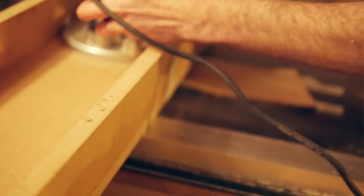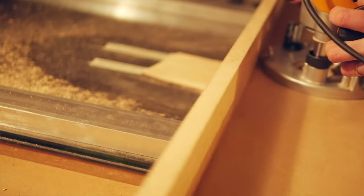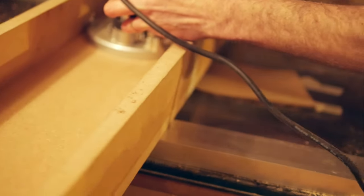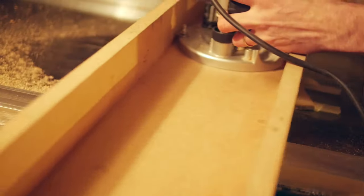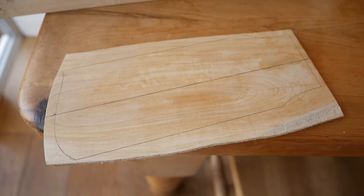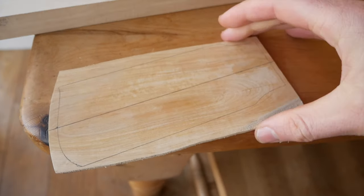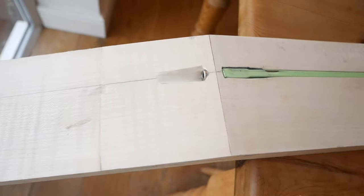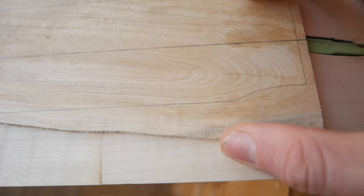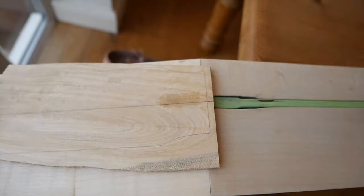After hand sawing up a few pieces of this wood and overtaxing my bandsaw to the extreme to resaw them, I ended up with a couple of candidates for the veneer. I took these close to the required depth using the router. There is a small crack in this piece that I've chosen to use, and again, I will fill this crack with thin CA glue to harden it up and hopefully prevent the crack from spreading. This wood does bring some strength to the headstock, but it's not entirely structural, so it should be up to the job.